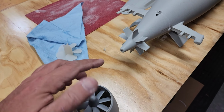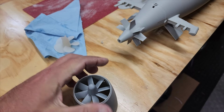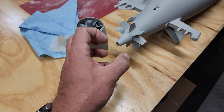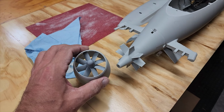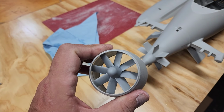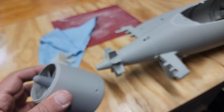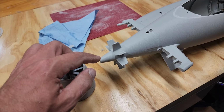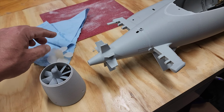So we're going to have a vortex that goes this way, and then the stator going this way, and the two should, in theory, cancel each other out and end up with a fairly linear flow of water coming out the back. We'll see. That's a really sharp angle on there. I don't know. We'll see. Worst case scenario, I can knock it out and not use it. But that's the idea. I might even just play around with this a little bit here this morning, because it'll just take a minute to knock this, put a bushing in, and get a propeller in place.